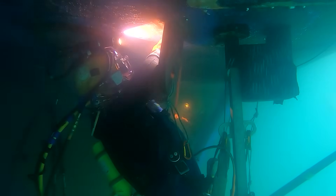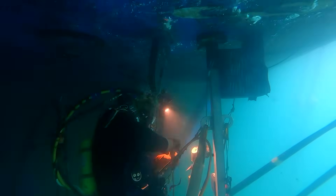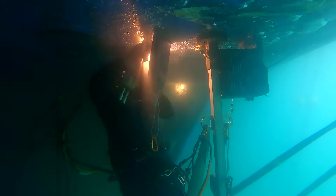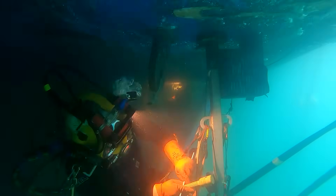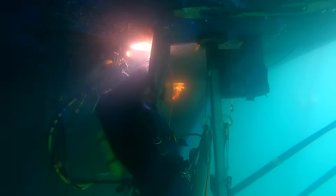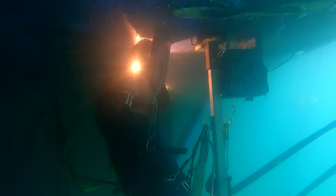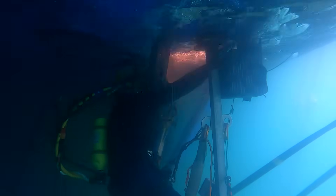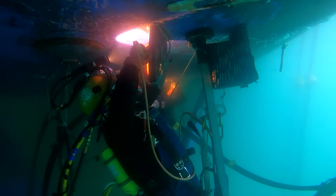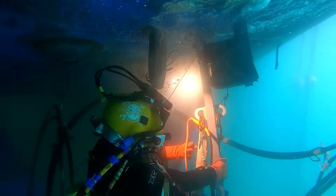You can see I'm starting on the inside of the pad eye where the angle is the greatest — an acute angle right there. When wet welding, you always want to start at the lowest point on an object, because of where your bubbles and steam go. Basically, you're boiling the water behind those two pieces — the pad eye and the ship hull — creating steam that can blow out on you. If you weld the outside first and then go inside, your bubbles and steam will hit the back of that weld and come right back at you. The root is the most important part of any weld, so always start from the lowest point.